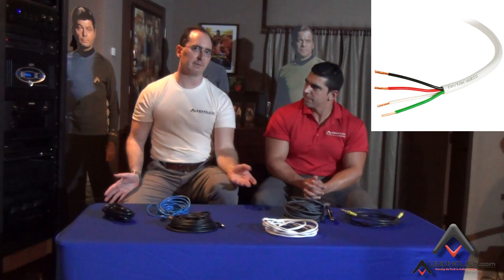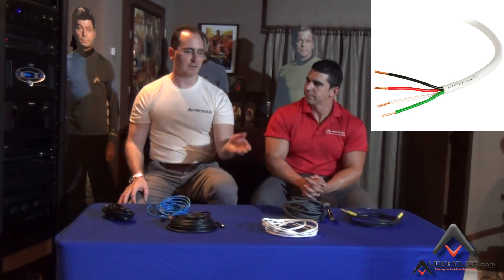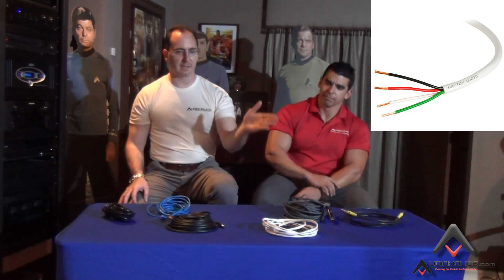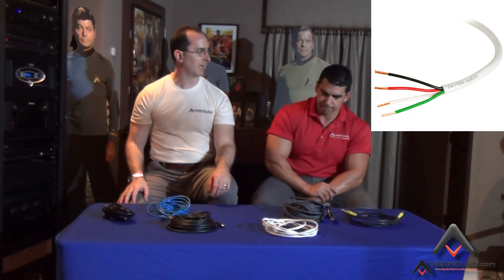When doing speaker cables, I'm always into really low-gauge, low-resistance cable. I made the mistake of running 10-gauge two-conductor cable — very unmalleable, hard to work with, hard to terminate. It's great from a resistance and performance standpoint, but it doesn't have redundancy. Instead of going with the 10-2, BlueJeans Cable makes a 14-4 cable. The 14-4 is nice because it has almost the same resistance as 10 gauge — equivalent to about 11 gauge. But now you've got four conductors. If sometime down the road you want to upgrade to Dolby Atmos and add a speaker with a driver firing up at the ceiling, you can use that extra pair of conductors for an Atmos speaker. And if you're not using it for Atmos, you can tie the leads together and get resistance close to 10 gauge.